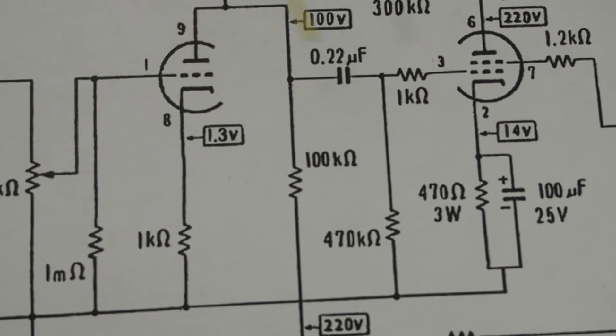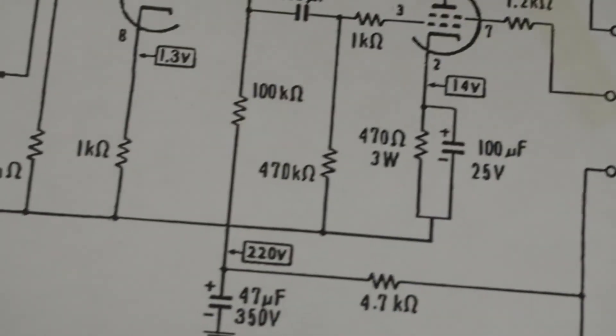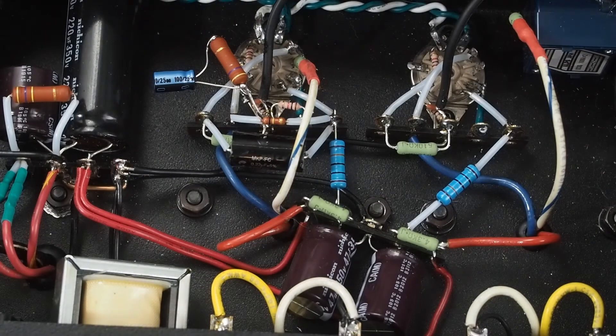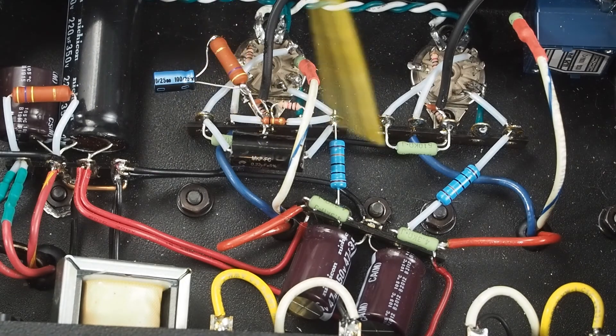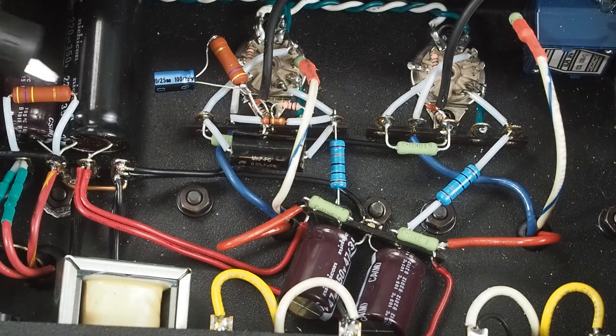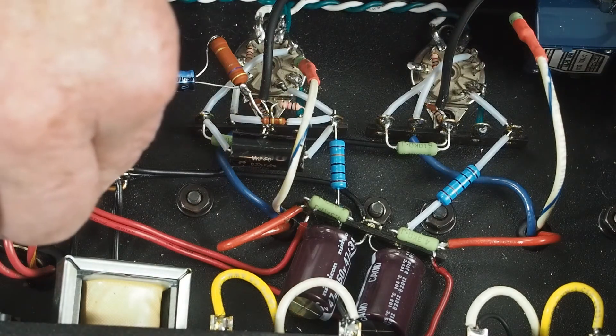Calculating for a few losses, that's about 65 milliamps. At 71, we want to be a little short of what the transformer is rated. If you're bumping up near 70, even maybe 75, you'll probably be fine — but you don't want to go over that. Be prepared to check this voltage.